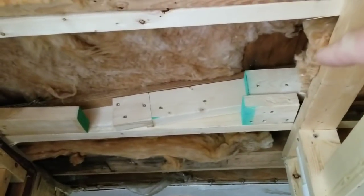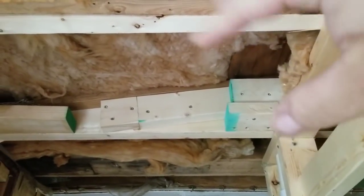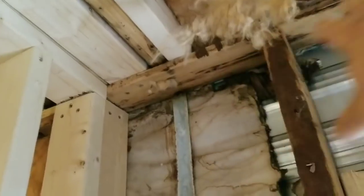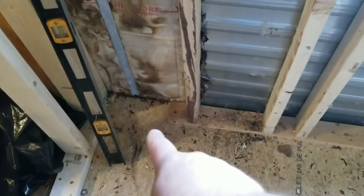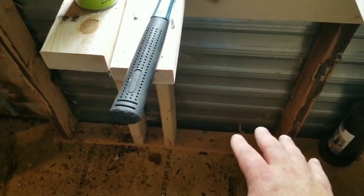First, as you've seen, I went extremely overboard. This right here — totally not necessary, I don't know what got into me. So anyway, you can see I've got new two by fours going up all the way across. Now this wall right here that the window's in — this whole wall is going to eventually get rebuilt as soon as I get a window. I need to find out what window I get, that way I know my measurement and can tear this wall out, make the header one full piece and tie it into this wall. Same as down here on the lower plate — I'm going to replace that one by three and actually use a two by four.